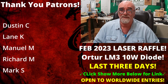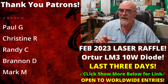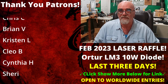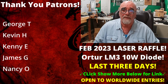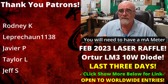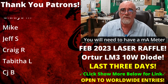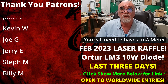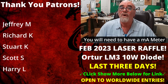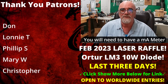You don't even have to believe my videos — these are just the results I get. My oldest K40 is five years old and the one I gave to a friend is still running on the first tube. That's because I dialed in the power. It doesn't matter if you have a regular K40 or the Monport — on a regular K40 you'll have a different control panel with power up/down buttons, but you'll still need a milliamp meter installed so you can turn the power up until you reach 17 or 18 milliamps.